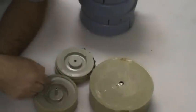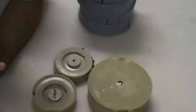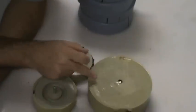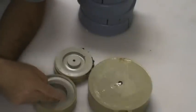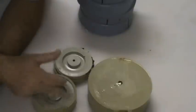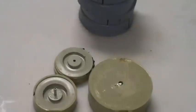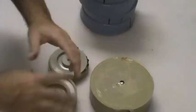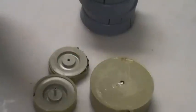Once you get all the tires poured, if you have any rubber left over or ran short, just mix up a little extra. Once you pour one set you can pretty much guess how much you'll need next time. Once you have that done, take your little hobby torch, get it fired up, and from about four to six inches away — maybe a little closer depending on how hot your torch gets — just work your way around the rubber. Same as with the casting resin: you're heating that stuff up so the air bubbles can pop up to the surface quicker. Just keep working around, a couple of times, until you run out of air bubbles to get out. Then leave them apart — don't try and force them together because all your rubber is still liquid underneath.